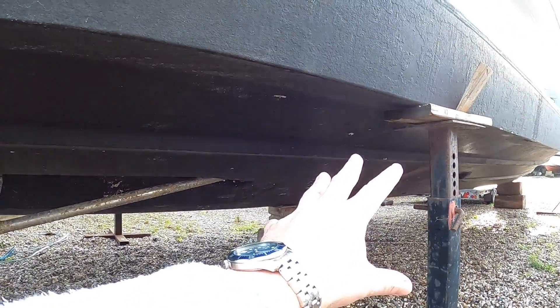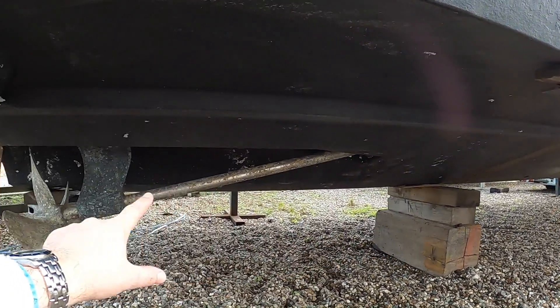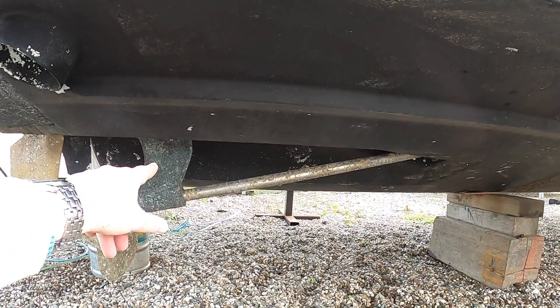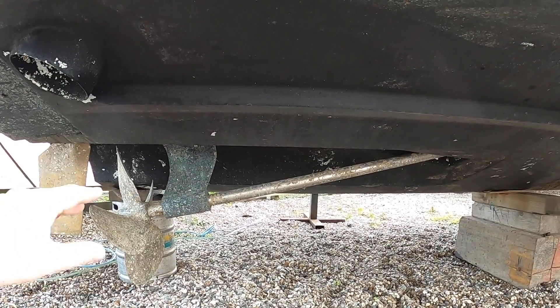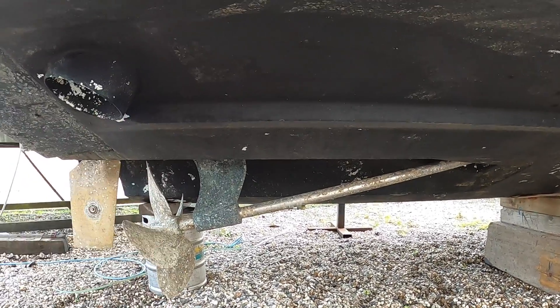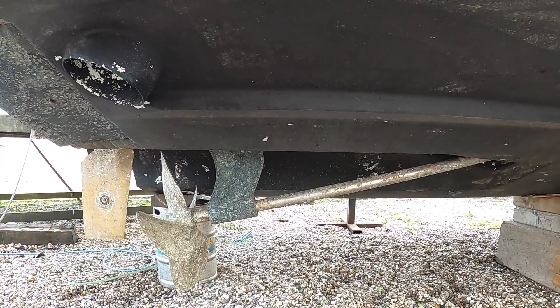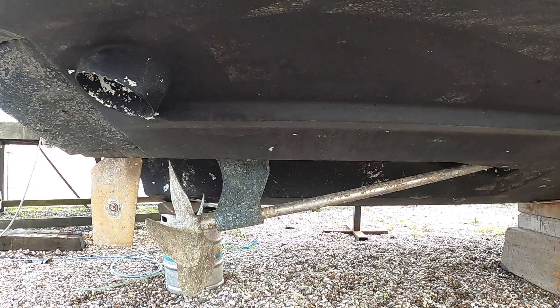The big advantage with this is just how incredibly simple it all is. You've just got the engine inside, gearbox inside. On the outside of the boat is just this stainless steel shaft; the P bracket is bronze, the propellers are normally bronze, the rudders are bronze — very tough, very easy to maintain, and a very sturdy system. This is probably the oldest system of driving this kind of boat. You'll find boats built in the 50s that have this system and they're still going strong.